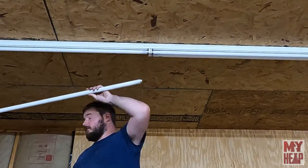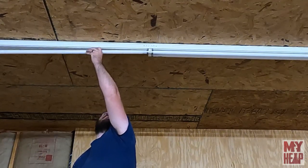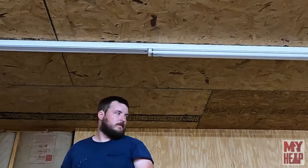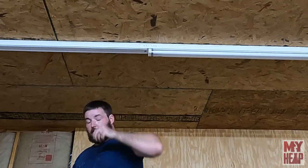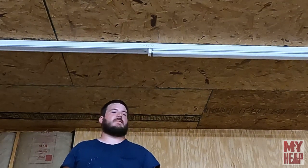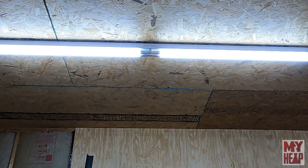Mike, you've done three of the four lights — this is the last one. Just one more time for the subscribers: what do you have to do to make these work? These are ballast bypass LEDs. You cut out the ballast, take one side and wire it to the hot, take the other side and wire it to the neutral — and that's that. Let's flip that breaker back on and see these things come on. Actually, you've been a hundred percent so far. There it goes — they're on!